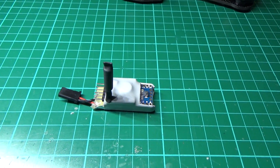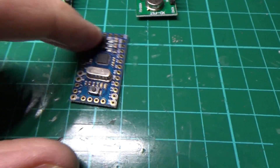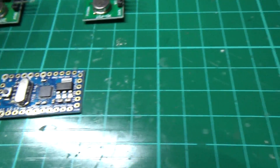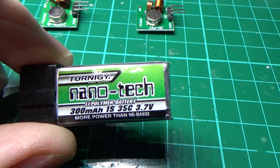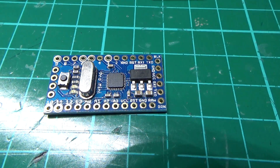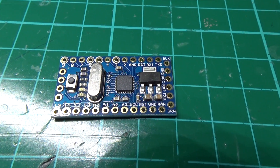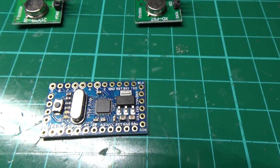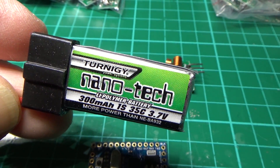What you need is an Arduino Pro Mini — these are the 3.3V version. You can actually use the 5V ones, but I'm also using one of the single cell nanotechs. If you use the Arduino 5V they take a minimum of 5V; the 3.3V takes a minimum of 3.3V on the raw voltage pin, so you can use one of these directly with it.